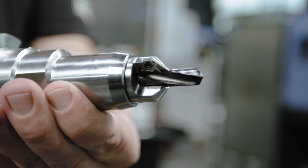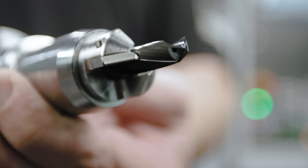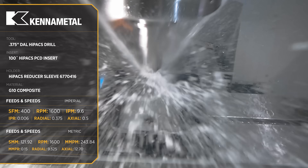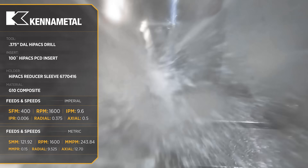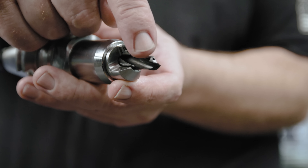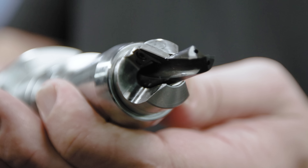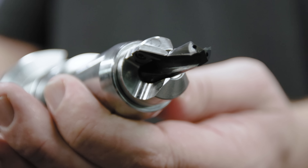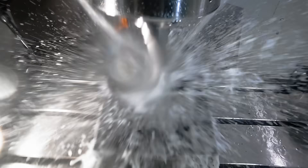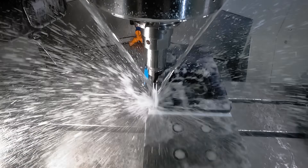And that's secret weapon number three: the HIPAC system. The HIPAC system consists of a DAL drill bit that's specifically for composites, laminates, carbon fiber reinforced polymers, and metal composite stacks. In aerospace fastener applications, you need to hold a tight angular tolerance of one degree on a chamfer. In the center we have a diamond coated drill, and then a diamond coated chamfer insert that's capable of holding that one degree angular tolerance with no problem. One of the benefits of this tool is that you're able to just replace the insert or the drill bit rather than replace a full custom step drill — meaning your price per hole is gonna be reduced dramatically.